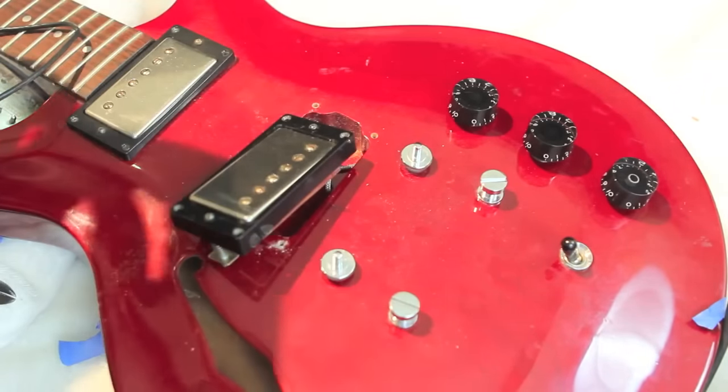Again, be patient here — it may take a while to get the pot up to adequate heat. As you can tell from looking at this guitar, there's a little blob of solder left from previous installs, and I'm just going to melt that until it's a nice runny pool and then put the wire in. I suggest you don't follow my example here and use the pliers to hold the wire instead of your bare fingers. Once it looks nice and runny, press the wire into place and let it set. There — it looks good. We're all set.